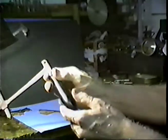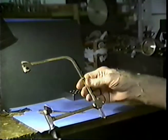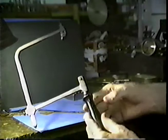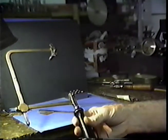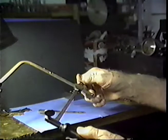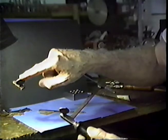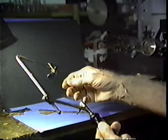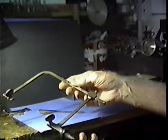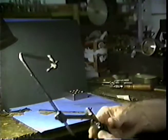Let's look at the saw frame. This frame is approximately what most people buy when they are looking for a jeweler's saw or a clockmaker's saw. It is adjustable with a screw for length, has a clamp for the blade at either end. This frame is made in Germany, imported by the Hamel-Riglander company, and is a very popular frame.